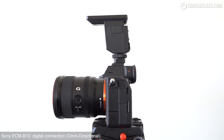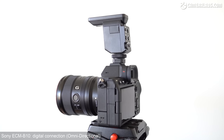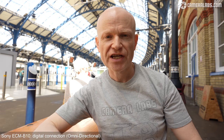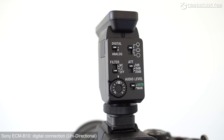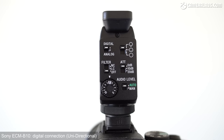It's very important to note that this microphone will work when connected to any Sony camera, so long as it has that multi-interface shoe. It's going to be an analog connection on the older models, but on the newer ones you have the choice of analog or, as you're hearing now, a digital connection. I've switched the microphone to its middle pattern — it's got three different ones that I'm going to demonstrate to you. This one is still going to capture some ambient sound, but rather than doing 360 degrees all around the camera, it is concentrating on a 180-degree area right in front of the camera, so it should be hearing me but also those things you can see in frame. Now I've switched to the third pattern — the super-directional shotgun mode, so it should now be very much concentrated on the sound coming from directly in front, which is ideal if you're presenting a piece to camera.